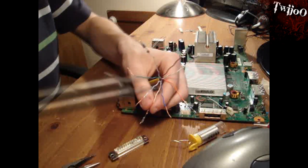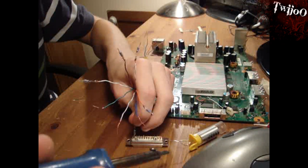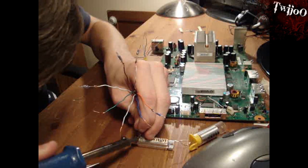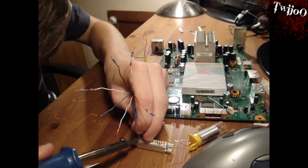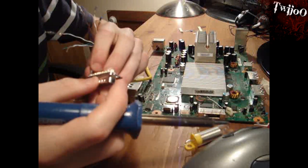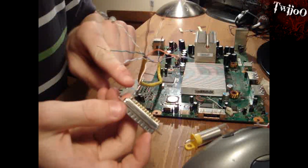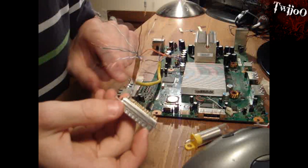Let's have a look - try and get it in. You also need to make sure that you're in the right holes, and that you don't get any solder on a separate pin - you only get the solder on the pin that you're trying to solder, because that will short it out. I'd also advise wrapping some insulation tape or electrical tape around these connections so that they don't touch once they're all together.